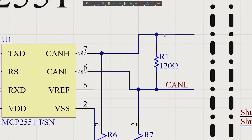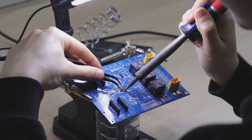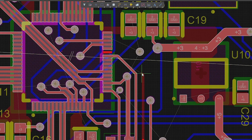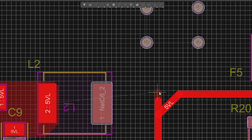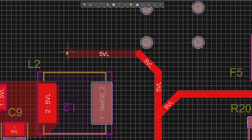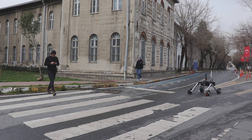Communication between electronic devices is provided by the CAN communication protocol. On the STM32 series microcontroller, we use motor driver, encoder, power distribution, BMS, and robotic arm modules in the Rover's electronic system. We also designed custom sense PCBs. Our team designed a CAN bus motor driver that allows us to control motors with PID. The power distribution board converts 24 volts to 3.3, 5, or 12 volts via high-efficiency regulators for the Rover's electronic components.